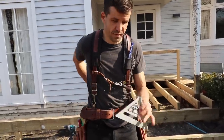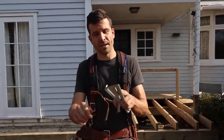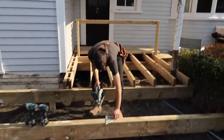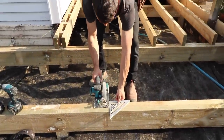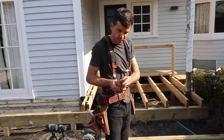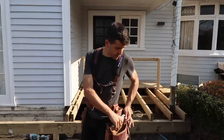A speed square — I would recommend either this or a combination square, but this is pretty handy for when you're first starting out and you don't know how to cut. You can put that against the wood and it gives you a straight line to cut to, so if you're just starting out and you're not really good with a skill saw, that could be a handy thing to have. Also a nail punch, a knife, a folding ruler, and a tape — you definitely need a measuring tape.